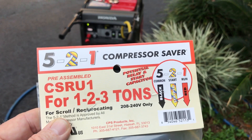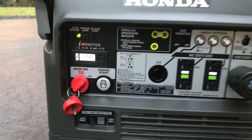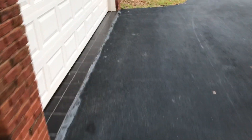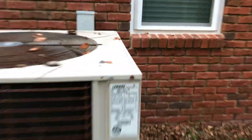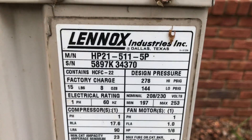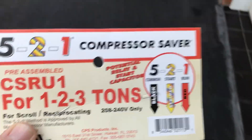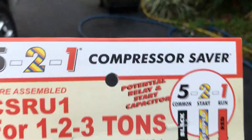What we have done is put a hard start capacitor kit on a 4-ton central unit. We've got it in regular mode, not eco mode. Let me show you the air conditioning we're about to attempt to start — it is a 4-ton central air conditioning unit. The one over here on the right is the big one. Right now it's not running; we've got the house on generator power. With this little thing installed, we're going to see what the Honda generator will do with a 4-ton unit.